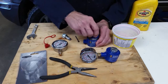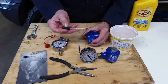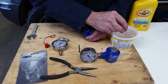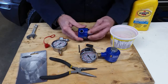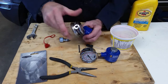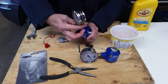What I did was assemble it and tighten it up by using a pin in one of these holes. Once I got it done, I set it up on its edge and used an eyedropper, because down in the bottom of this little tube there is a very small hole. When you just add fluid to this area it airlocks, so it's a pain. I would suck up fluid, push the eyedropper down into the hole, give it a squirt, and it filled up. Once I got it full to where I thought the level should be, I assembled the gauge inside it. Then very, very slowly with it upright, I pressed in on the piston to displace the air until I didn't get any air coming out around the gauge. I finished off by tightening it up with a wrench and it worked perfect.